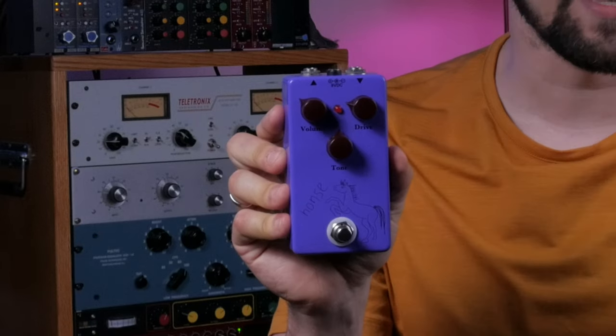There are two ways I know of to get around this. Your first option is to use a high-quality, low-capacitance cable between the unit and the amp. The shorter, the better. The second way to mitigate tone suck is by using a short patch cable and a buffer coming out of the reverb tank. This could either be a dedicated buffer pedal or a pedal with a built-in buffer you already own. For example, if you have a pile of Klon clones laying around, you could slap one after the tank and leave it in the off position to take advantage of its buffer.